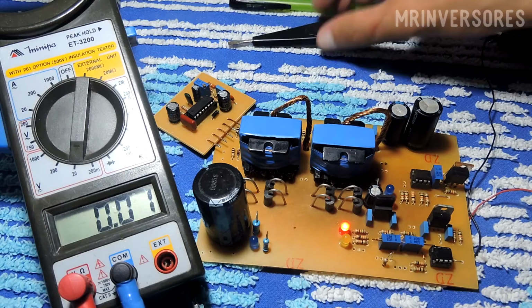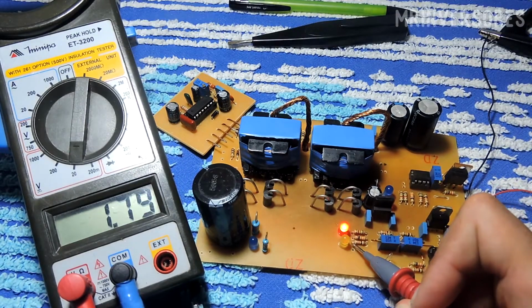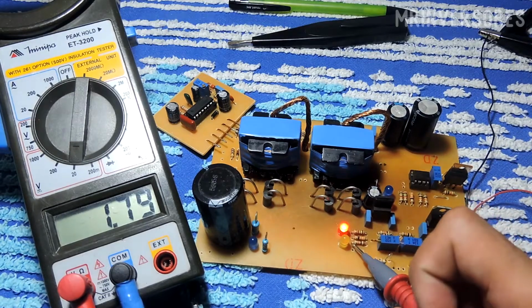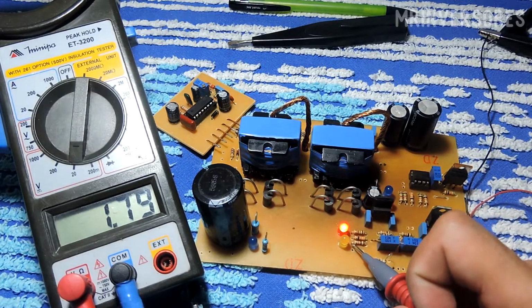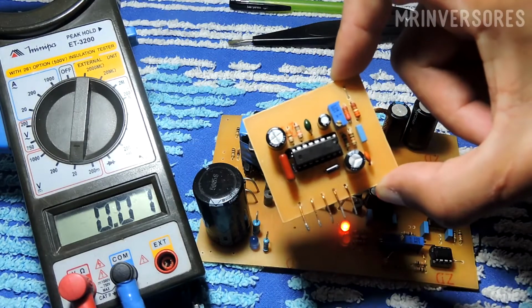So here, beauty, it is already at high voltage and we will see here the voltage sent negative to the MOSFET gate, so with high voltage it would also cut the other MOSFET, it would disable the voltage for this module, which would cut the inverter, it would shut down, right?